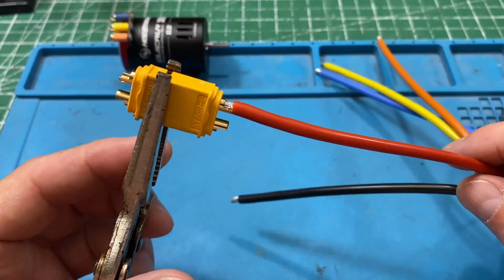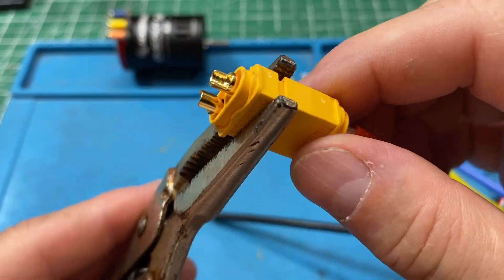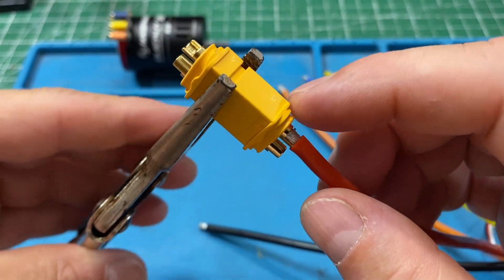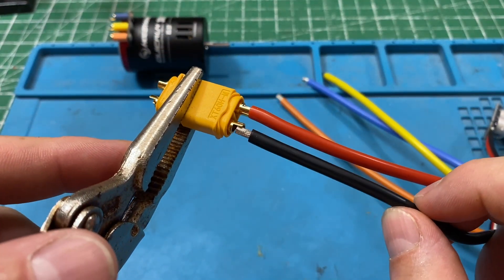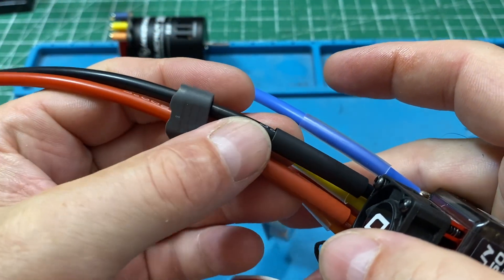As you can see on the ESC side, it takes the female connector. I'm using XT-60s. I like to plug in the male end there to help dissipate some heat while soldering. It's very important not to mess up the polarities, so you want to make sure the red wire matches up with where it goes on your batteries. Make sure you put all your pieces on your wires first, so you don't have to go undoing all that beautiful soldering.